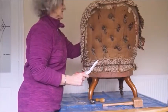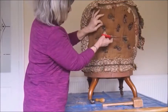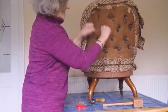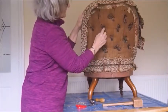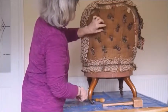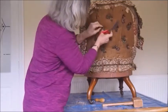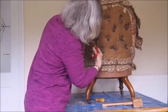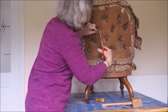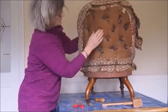I've taken off the front and cut all the stitching. You can see how much turn there is - he's left a good turn on that. There's the little arm - you can see how much they've overlapped and cut into it with a little V shape to accommodate the bend. There'll be lots of cutting and folding on a chair like this but that gives you an idea of how much extra fabric you need. To release the front we need to cut through the buttons - we have no choice because we need to put new ones in. These bits of cloth are to hold the string; you pull it through, put the cloth there and tie it - they stop the string going back through.